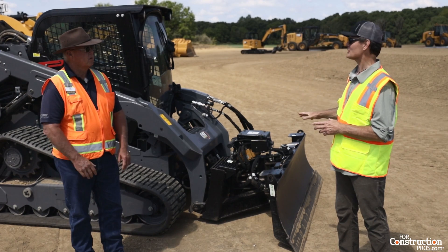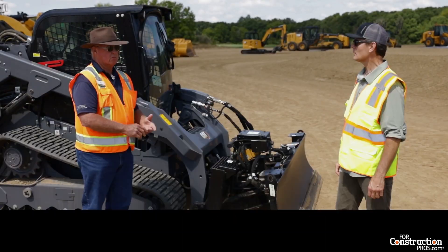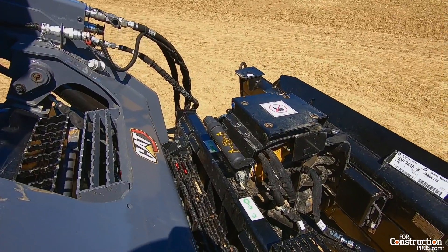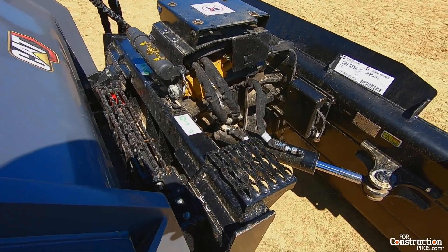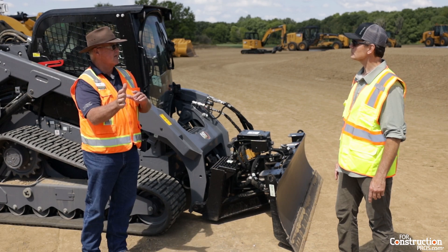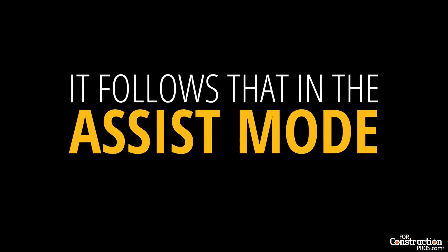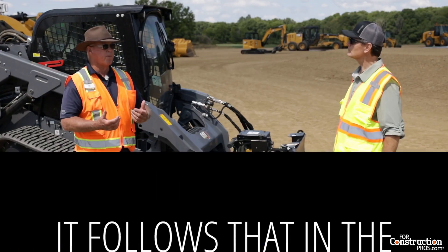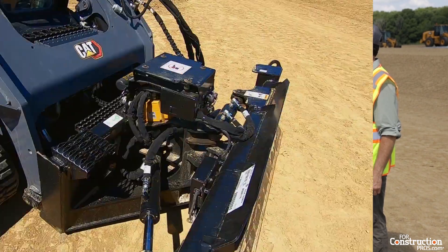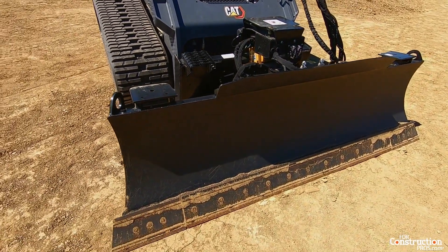The applications for this intelligence in a dozer blade include land clearing, grubbing of ground, fine grading, parking lots, buildings, cutting ditches, and cutting grade. With the optional IMU you can add to the car body, the display gives an indicate-only of mainfall — telling the operator whether they're running flat, building a three percent rise, or going down three percent. When you set your slope assist for one, two, or three percent grade, it follows that in assist mode, making fewer passes, saving fuel, and reducing frustration for both novice operators and those with 20 years in the seat.